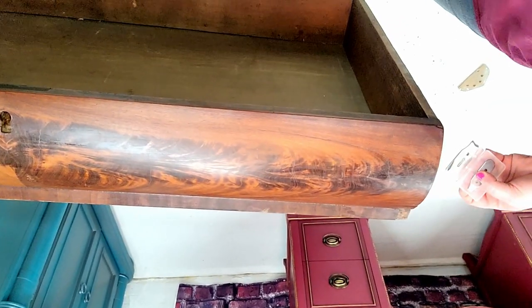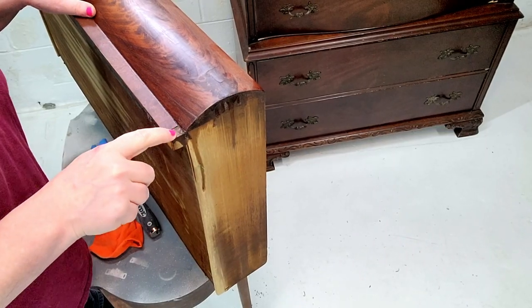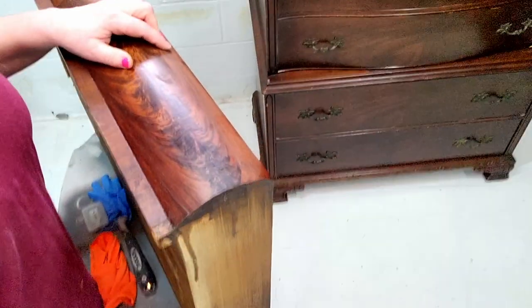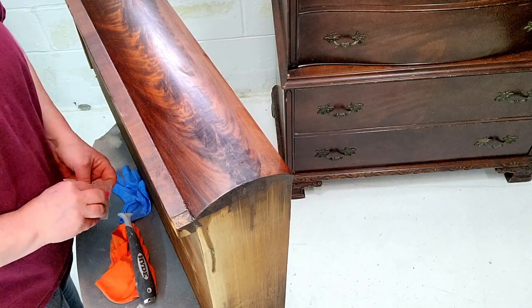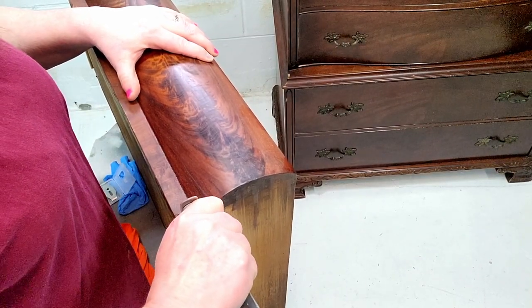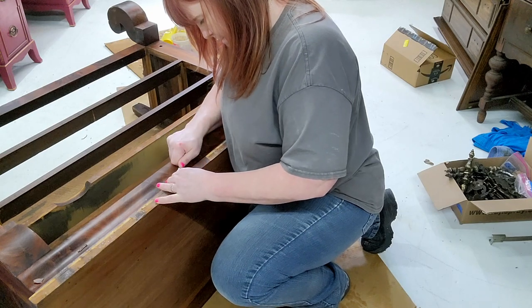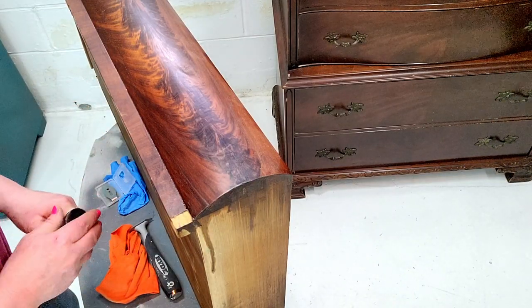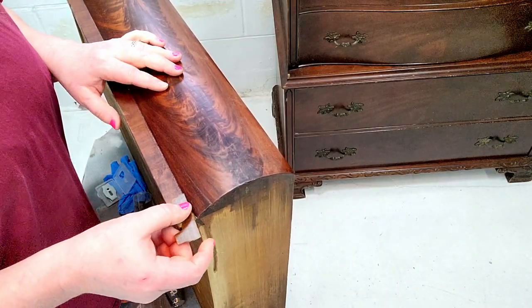When I went to wipe this one down I noticed I had missed a repair right here — we're missing a little piece of edge banding on this drawer. It's got a lot of glue residue here, so I'm just going to remove that, make the repair, let it dry, and then come back to give it its shellac. Because we kept all of the pieces of that edge banding we took off earlier, we've got a way to repair this with the same wood it came from — so there'll be no chance it won't match up.